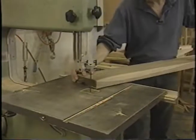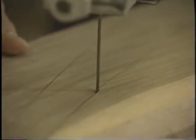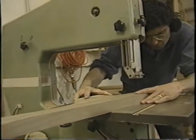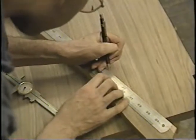With all of the plank notches cut, I move on to the legs. I've marked both the front and back legs with my patterns. For now, I'm bandsawing only the outsides of the legs, the sides that won't be notched. I measure the thickness of the seat plank carefully at each of the joints. Then mark out each corresponding leg notch with this dimension.